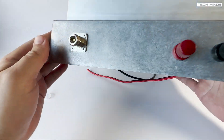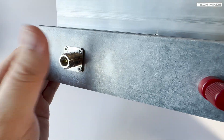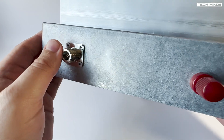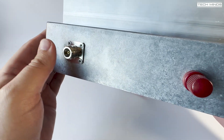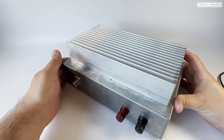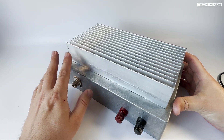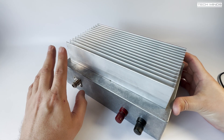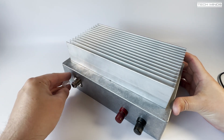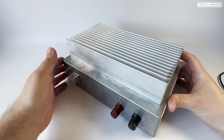There's an N-type female which is going to be the output, going off to the antenna or the patch feed. In between, there's going to be a circulator — a terminated circulator in case of any SWR issues — and I'm also going to have a minus 40 dB coupler so that I can take that off to a power sensor to monitor the power output. I'll show that in the next video when it's all wired up.